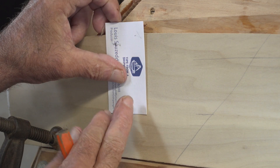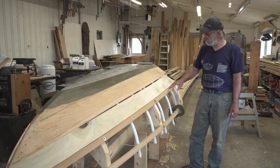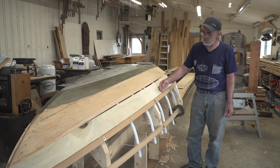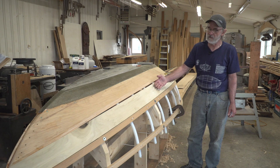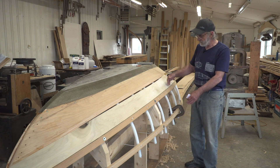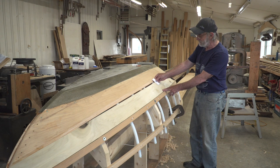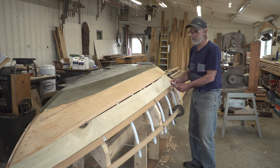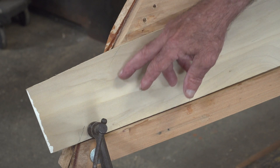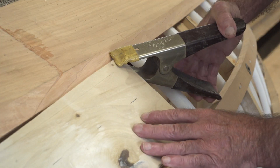Now we've got a full pattern of that section of the binder strake — the first binder strake we're going to put on the boat. There happened to be a stringer right here that I put right on one of the planking lines, so I decided to fit the pattern up against that stringer because it's already stretched and faired right through that planking line. I did that first, then used my business card to spile the other side onto the pattern. Now I've got a full pattern going all the way forward, marked at the forward end of the stem. I can take it off and go searching for a piece to make that plank.